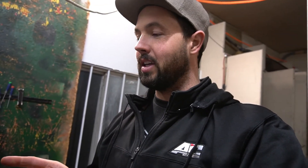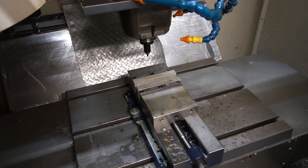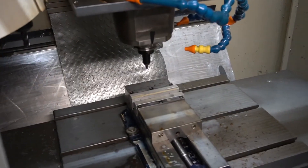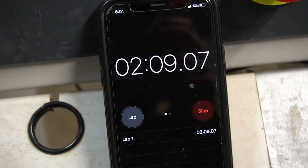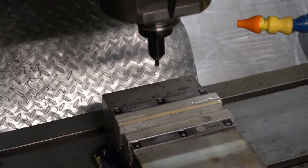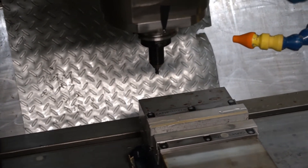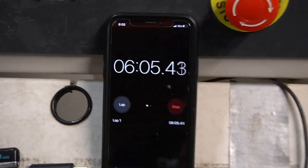So we're gonna bump it up to 200 inches a minute. Just for old time's sake, we're gonna see how long our program takes on a stopwatch. I'm gonna press the stopwatch — here we go. Here's 200 inches per minute. Still not very exciting, but for this old Arrow that's pretty good. Still sounds really good. The true test will be the 3D toolpaths — the up and the down — that's kind of where Z was making a little bit of a lash noise last time. Total time so far is 2 minutes and 11 seconds going into our 3D toolpath. The motion looks good, just getting a little bit of that sound in the Z ball screw still, but the motion looks pretty fluid. We just finished at 6 minutes almost exactly — almost exactly 6 minutes at 200 inches a minute.